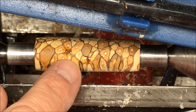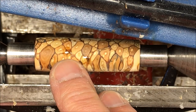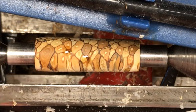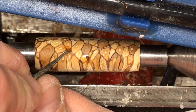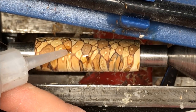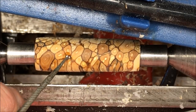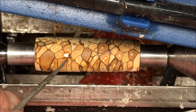These two I think I filled before because they looked like they had CA around them — I think it just did not soak. I see a bubble. I don't know if you can see it in the camera, but there's a bubble inside of that one. Let me grab something and get rid of it. I've got this little file, and I'm just going to stick it down in there and pop that bubble. By popping the bubble, the CA glue goes down into the void a little deeper. It's still got a little bit of a bubble in there — and there we go, it's gone now.